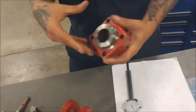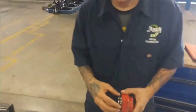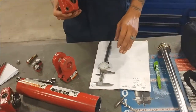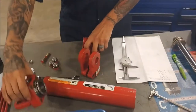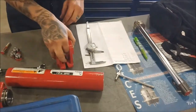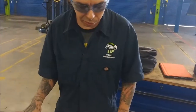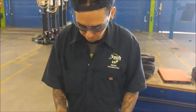I'm guessing this was just kind of overloaded and it blew that cylinder out a little bit. That would also tell us why this rod has a slight bend in it - the slight bend is on the side where you would thread the clevis assembly on. We're doing a little bit of investigation on it. This is just a trainer; all we're doing is taking measurements and going through the motions. But we can obviously detect what happened to our assembly here.